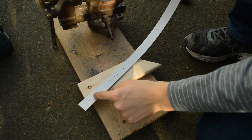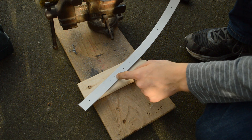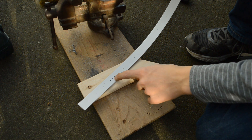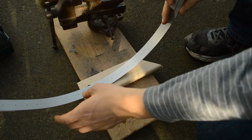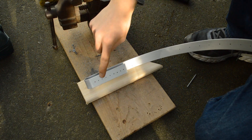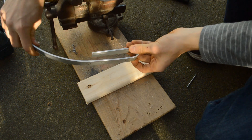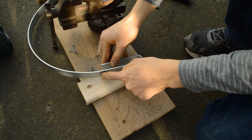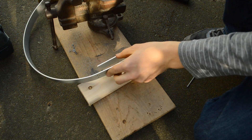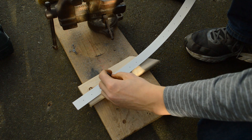I've marked out a bunch of holes with a permanent marker, spaced about an inch apart. I have a couple really close together and I'll show you what my plans for those are a little bit later. I've got some more up here so I can put a weight out front if I need to, and a bunch back here for the handle mounting position, and similarly for the actual camera itself. I'm just going to take this nail, make some marks, and drill these holes out.